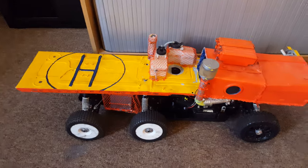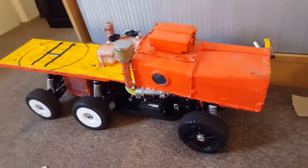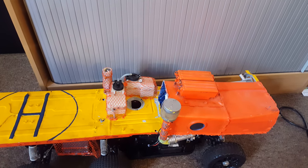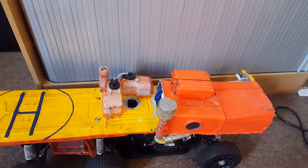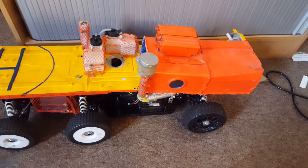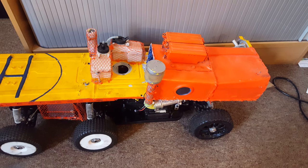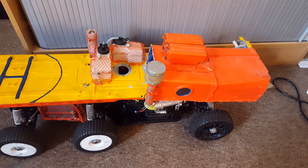But I just didn't have the heart to move it in without sorting the electronics out. What I did is I just nipped in there and I took out the cell from on top of the roof, and I've left it running at two cells. The two cells in series for 8 volts is more than enough power to run the servos and the servo leading to the fuel arm. So I'm quite happy with that one.